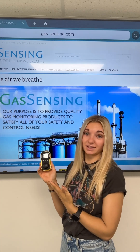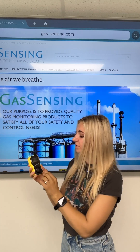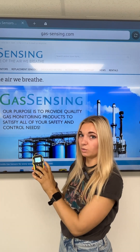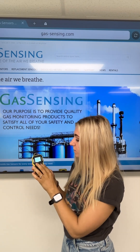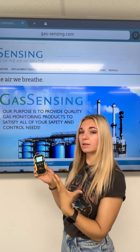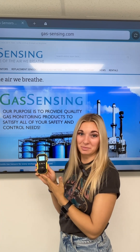If you don't feel comfortable doing this yourself, you can contact us at Gas Sensing and we can do it for you. If you're feeling confident enough to do it yourself, you'll simply hit the power button and find gas zero, which you'll use with zero air, as well as gas calibration. Gas calibration does require a password, so make sure that you're choosing something that's easy to remember, as you will need it any time you need to perform a calibration.